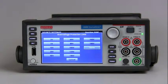For example, if a sense lead is disconnected or broken during a four-wire measurement, the instrument can interpret the missing sense lead as a decrease in voltage and respond by increasing the source output. If over voltage protection is set, the source output is not allowed to exceed the over voltage protection limit. The value set for over voltage protection takes precedence over the source limit settings.